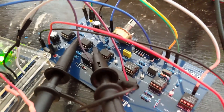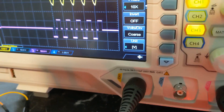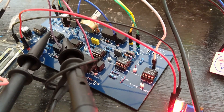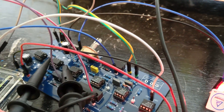If you remember, this first stage just takes one signal and flips it over — that's what you're seeing here in pink. One of these gets flipped over. The second stage kind of smooths it out — it's basically a low-pass filter, so it cuts out some of the corners. That's what you see there in yellow. I'm going to keep using this pink first stage as the trigger for my oscilloscope. The next one should basically look like the yellow — it's just a magnifier tuner, that's what the knob is for.